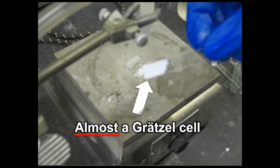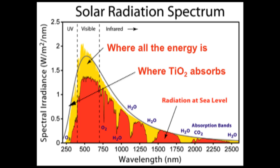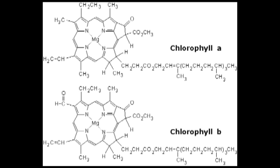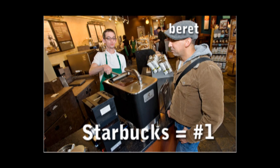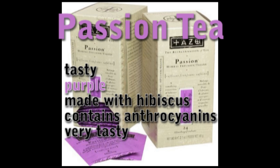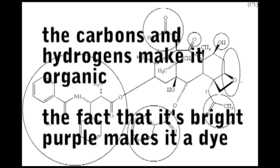What you've got now is pretty much a solar cell, but unfortunately it won't work with regular sunlight. We've got to make it a bit more colorful so it will absorb light that we can see. Pretty much anything colorful would work — we've tried juices like raspberry, pomegranate and red currant that seem to be okay. Chlorophyll can be purified from leaves with some ethanol and that works as well. What we've found works best seems to be a certain kind of tea from Starbucks. Passion tea is tasty, purple, made with hibiscus, contains anthocyanins, and anthocyanins are great organic dyes that have been shown to interact well with TiO2.